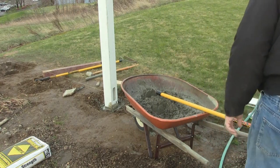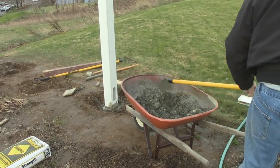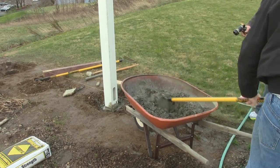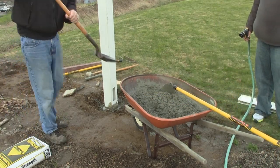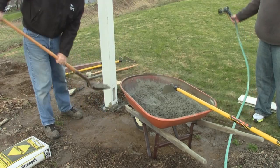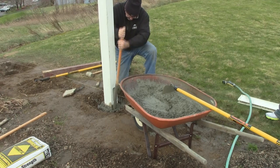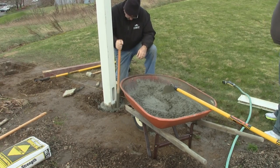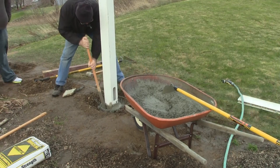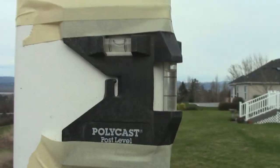I've already got a lot of the concrete poured on this first post. Be sure to double-check all your measurements before you start pouring concrete, because once you've got concrete in that hole it becomes very difficult to move the post. I've got my son helping me moisturize the Sacrete mix — two sacks per hole. Once it's all mixed properly, carefully put some down in the hole. An important step is taking a stick and mixing the concrete in the hole, making sure it's well compacted and mixed so it becomes very snug. Then one last check to make sure the post is straight up and down — I've got a level taped to the post.